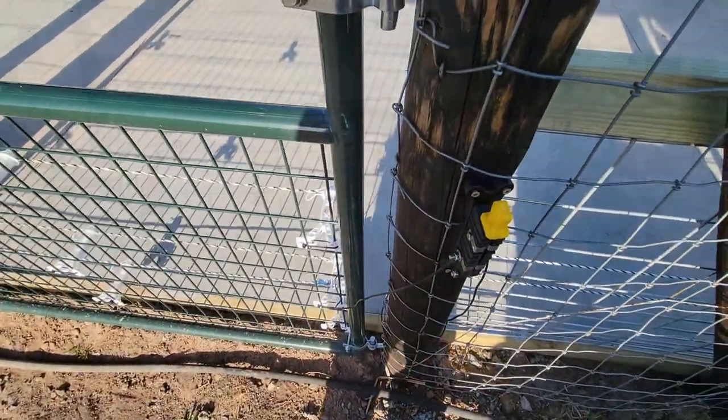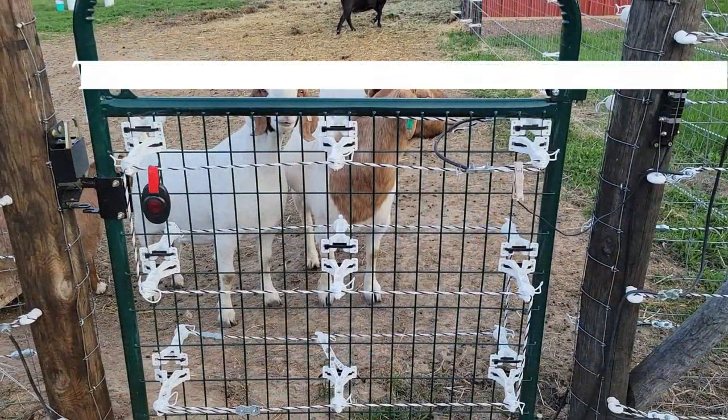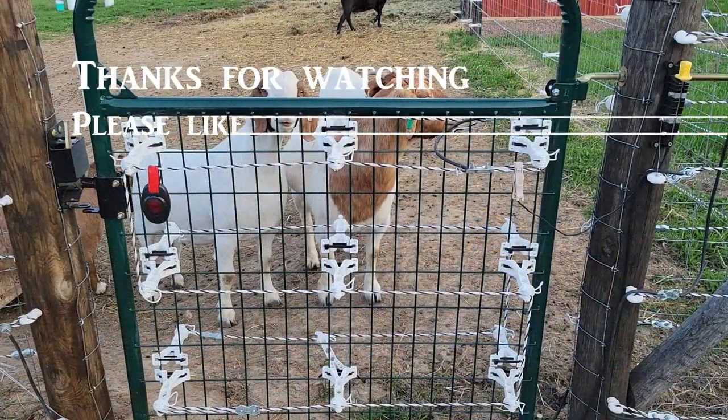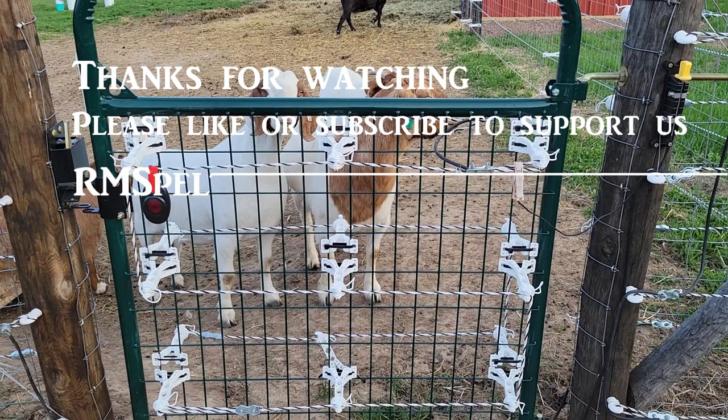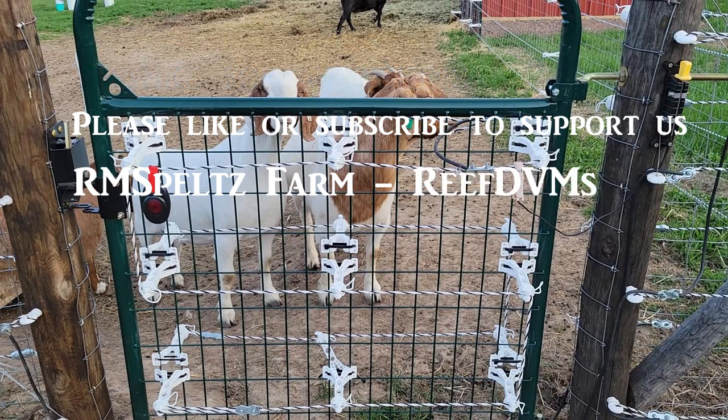I've got it at about a six-inch level, a 12-inch level, and almost 20 inches. They won't climb on this gate. I've got the latch on it that allows it to go up and down in the frost. I've got the knife switch on it — pull it down it's off, throw it up it's hot — and this gate will be protected. There won't be an animal riding on it or hurting it. Thanks for watching folks. This is how we make our gates really last — we wire them up with these Gallagher five-inch offsets in the universal style. You can buy them at ValleyVet, and I hope you enjoy your day.